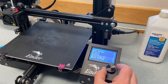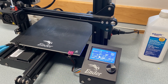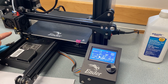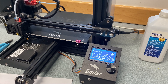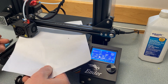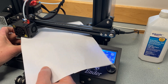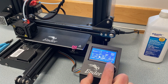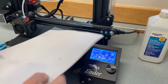Let's go - print from TF, CHEP M25 bed level G-code. The first thing it's going to do - and you'll need a piece of paper to do this - is adjust in the corner here to the home position. I want to loosen that off just a little bit, it's a bit too tight. So I'm going to turn to the right just a smidge until it just moves without too much effort. That's about perfect. Resume print. I have the paper ready to go.